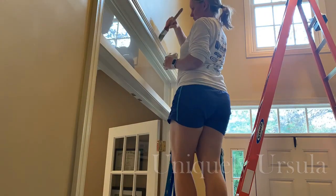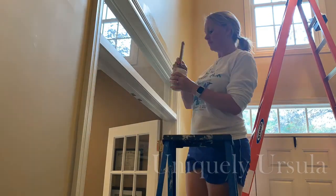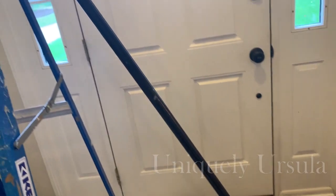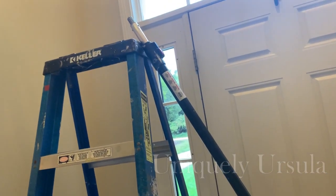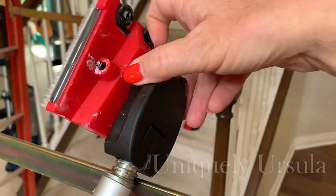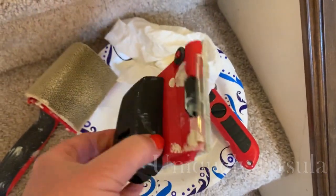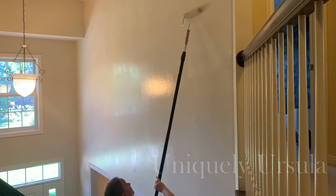What I used were both a 6-foot and a 12-foot A-frame ladder that we already owned, a painting extension pole that has threads on the end and could expand from 6 feet to 12 feet tall. And to the end of that, I could attach both the Shurline Edger Pro and the Shurline Corner Painter, along with just my standard 9-inch rolling brush.